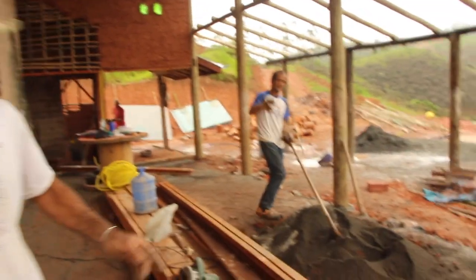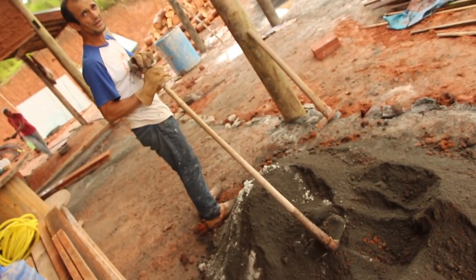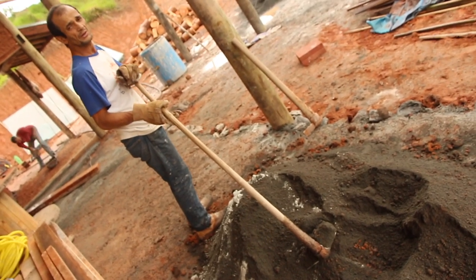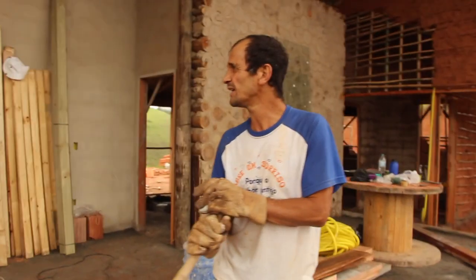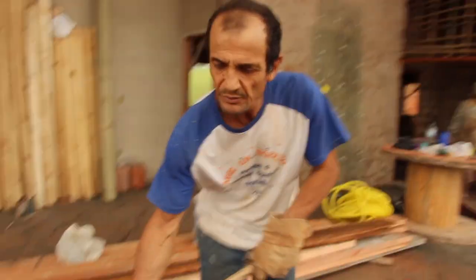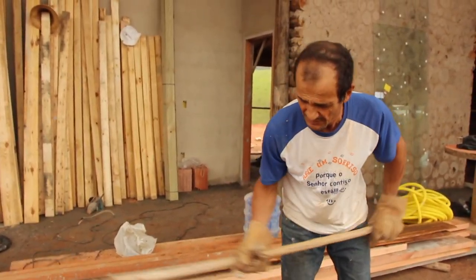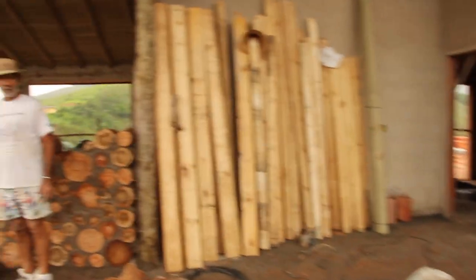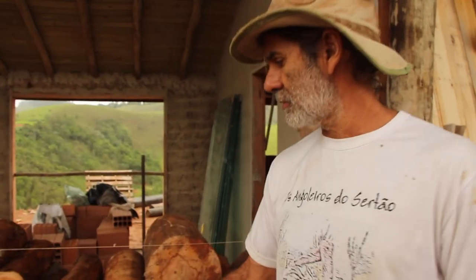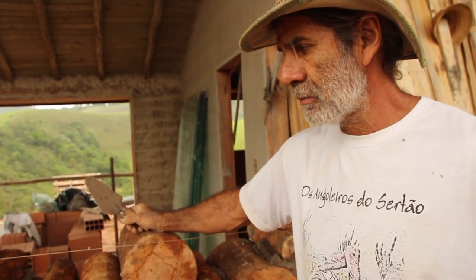Rob is mixing this mass. This here is the 3-to-1 mix: three parts stone dust, one part earth, and half a can of cement — an 18 or 20-liter plastic can. The earth here also binds really well. And you know by the feel of the mass whether you need a little more of one thing or another. We only add cement to make it cure faster — without it, the mix takes longer to dry. The mass is quite thin and weak.